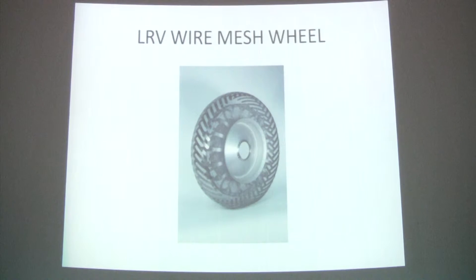It was a self-cleaning type of wheel. If small particles got inside through the mesh, they went out as well, and they did not have any problem of accumulating dirt inside the wheel. The load on the moon was only 67 pounds per wheel, so the flexibility of the tire had to be designed to such a low load. However, the inertia forces on the moon are the same as anywhere else in the world, so running the vehicle at 10 miles an hour and impacting a rock, there were high forces up to 600 pounds developed.